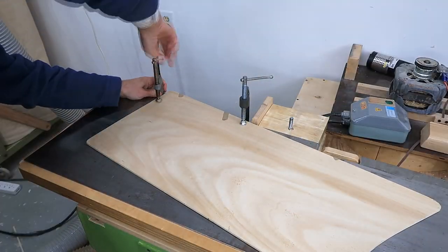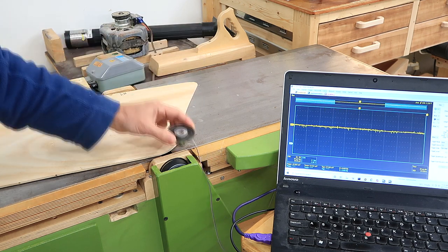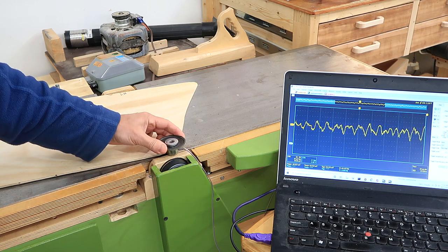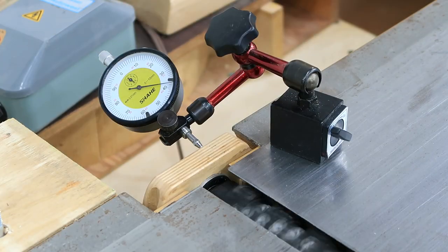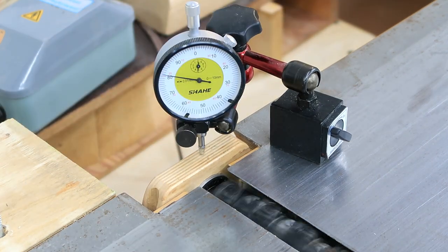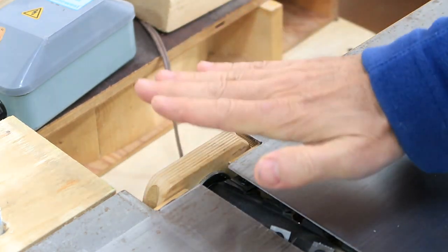This plywood will protect me from the cutter head while I'm probing for vibrations. The weird thing I'm seeing is more vibration on the ends of the bearing blocks than on the sides of them, which suggests the problem is something other than imbalance of the head. Somehow this seems to be rocking back and forth this way, not moving this way.